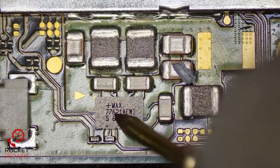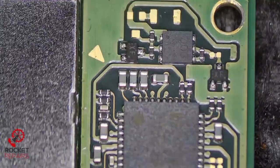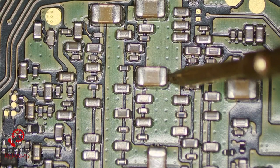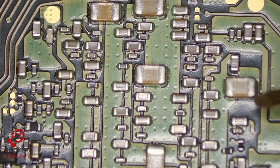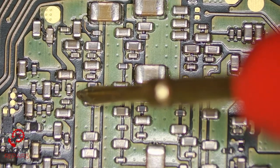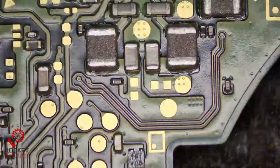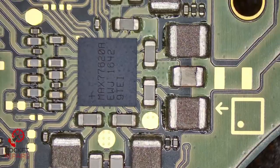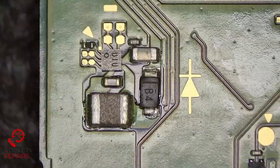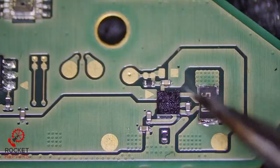We have the MAX IC here — nothing that I can see, no damage so far. All looks okay in my opinion. Just checking continuity on the CPU on the back. Some of these caps I know are low impedance, so it won't be the issue. We get 69 ohms there. From a CPU perspective we're okay. We're just having a look around — I can't see anything obvious at all. It's a little bit frustrating because we don't have any shorts. Could be that we change out BQ, give it a test, and then change out M92. It could be either of those.